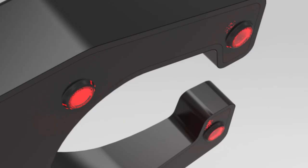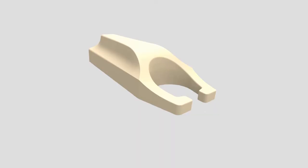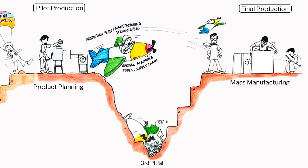We looked at the LED locations — and very interestingly, infrared is heat, right? Our first LEDs were such that if you kept the device on for more than 30 seconds, it would actually give a little pain. Rather than removing pain, you are giving pain. So we had to relook at the heat transfer in the PCB — we needed to consider transmissivity, put filters in the middle, and add heat sinks. See how complex the product becomes once you go forward. The students think it is simple: infrared gives you light, you throw it from the top and see the vein. Finally, we reached our third valley of death — we have finished the pilot and now need to launch it, but we are stuck with numerous issues that still need to be solved.